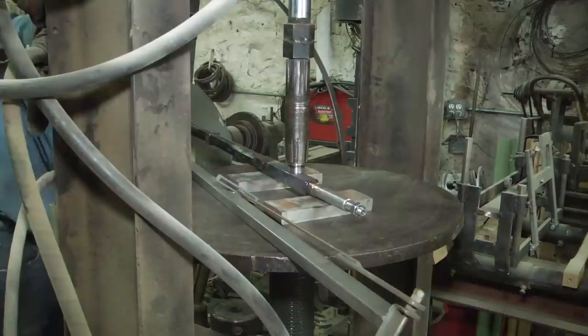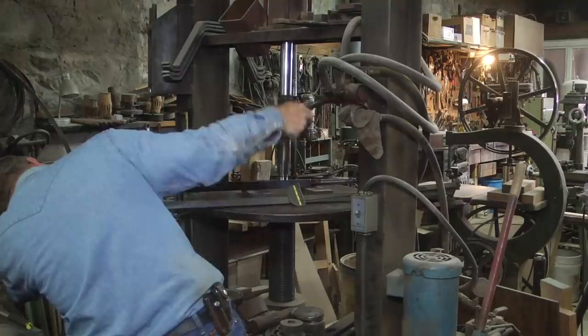Well, one of the main differences between those types of axle, using an axle gauge and a hydraulic press to push these spindles into their correct position, is that on a wood axle for a farm wagon, these measurements for the gather and swing have to be actually carved into the wood axle itself. So this video is going to go through the process of how I examine an old axle to find out where it is set, and give the general principles of how and why wood axles are gauged for a farm wagon.